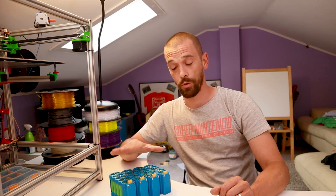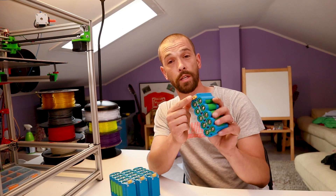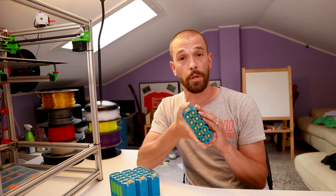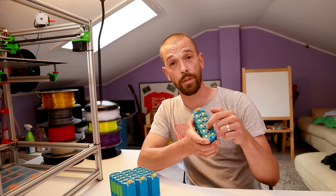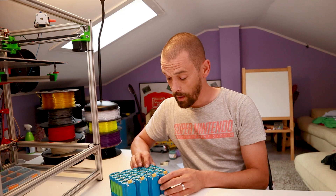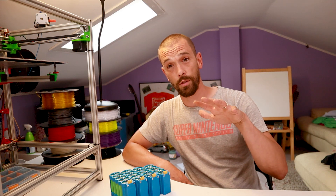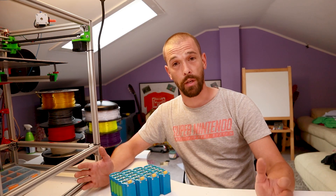The BMS will be connected to the solar charge controller once the parts get delivered. The whole idea behind this connector is that it's really easy to plug in and pull out again if you want to work on it. If you build a pack like this, I strongly recommend not using it for higher currents because of the limitations and decay of the bus bar. If you like this design, give it a thumbs up. If you've got any suggestions, let me know in the comments below — I'm really just getting into these batteries. Hopefully next week I can show you guys an update. Thanks for watching and see you in my next video.